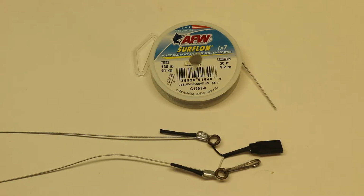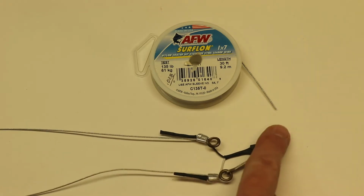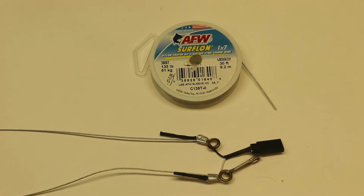Today we're going to make a set of insulated lines for flying control line models with down-the-line electronic controls. Now this could be Clancy Arnold's down-the-line system, Bill Young, servo driver, or the JRDSC radios, or any of the multiple systems that are out there where you have to send the signal and ground down the flying lines. The reason why you're seeing this connector right here is because that connector is used to transmit the signal coming from your device down the two flying lines.